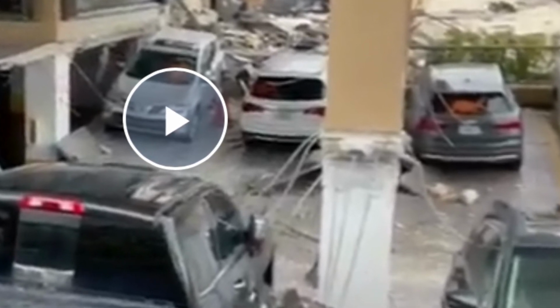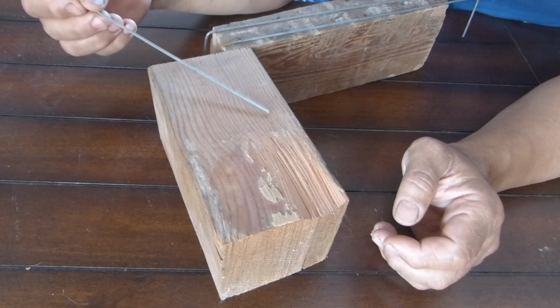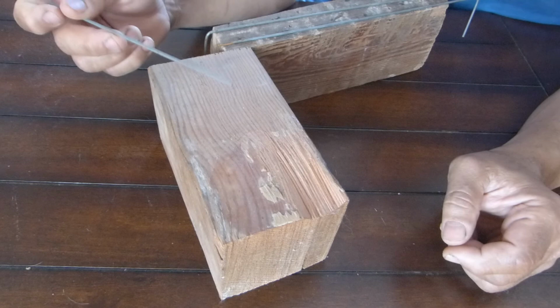It's the concrete and rebar marriage failure via deflection and bond break of the rebar in concrete from excessive loading or span issues. And then of course we have penetration, overloading with the slab. So we've got multiple attacks on this. They appear to be the same lengths. There appears to be no fractures. They didn't get shortened and fracture. The rebar didn't fail.